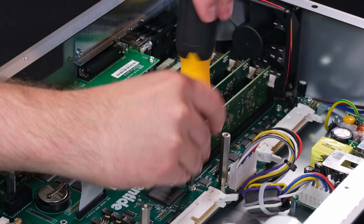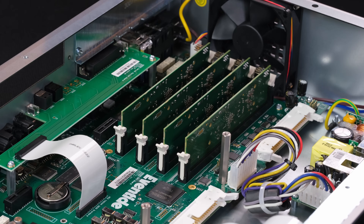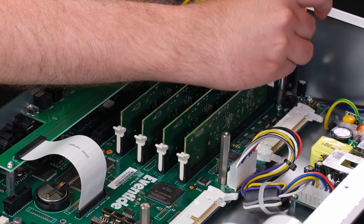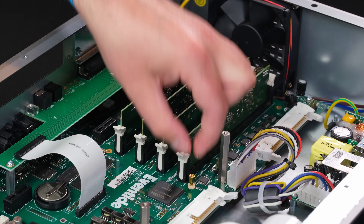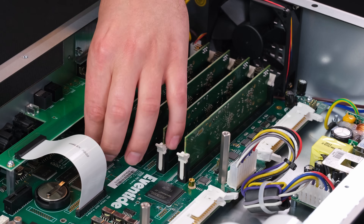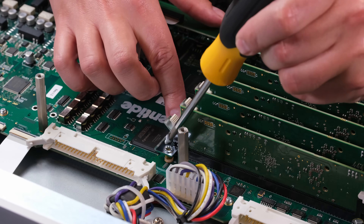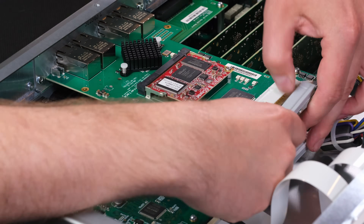If your H9000 did not previously have DSP mounting brackets, you will need to install four standoffs. Remove the four screws that surround the DSP modules from the main board, place a plastic washer, and fasten the standoff to the main board. Once all four standoffs are installed, place the mounting brackets and secure them using the lock washer and screw. Reinstall any expansion cards that were previously uninstalled.